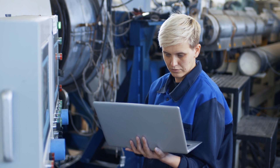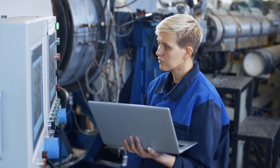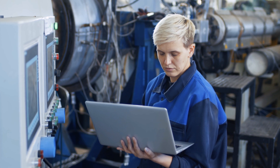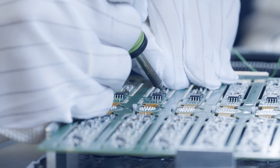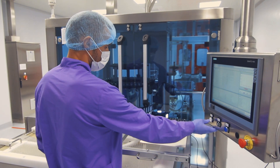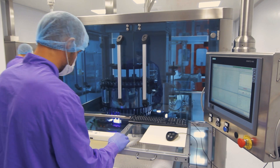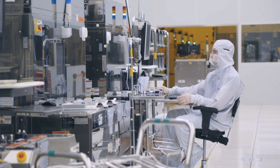We then audited their two contract manufacturers. The first facility was to build the circuit boards and conformally coat them. The cure cycle was supposed to be 76 degrees C for two hours. But we noted that the furnace was at 70 degrees C and the boards were coming out in less than five minutes. So clearly, the cure cycle was incomplete and the boards were very, very tacky.